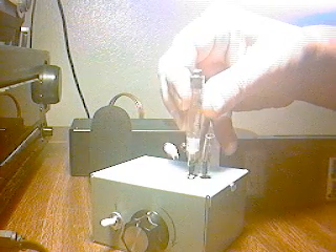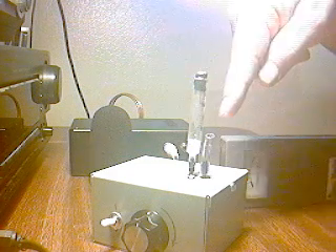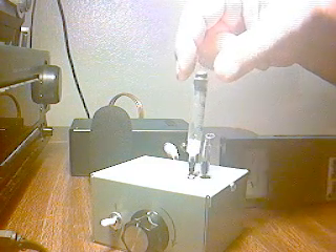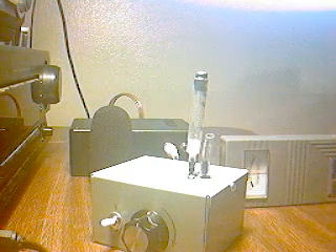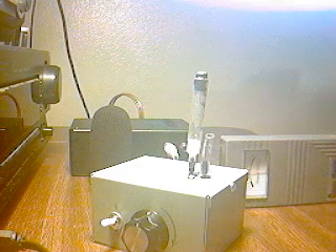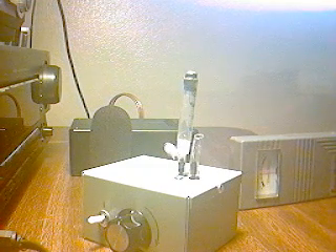But now I'm going to put the sensor tubing back in place. This changes the frequency response of the sensor to infrasonic. So the tuned backing volume and capillary leak, along with the circuitry inside on the output of the Honeywell chip, tunes it from 0.05 to 20 cycles. Both of those together make an infrasonic frequency response microphone. And that microphone is plugged into a Gauss Master using a voltage controlled oscillator so that you can hear the infrasound converted up to audio that people can hear. Thanks.